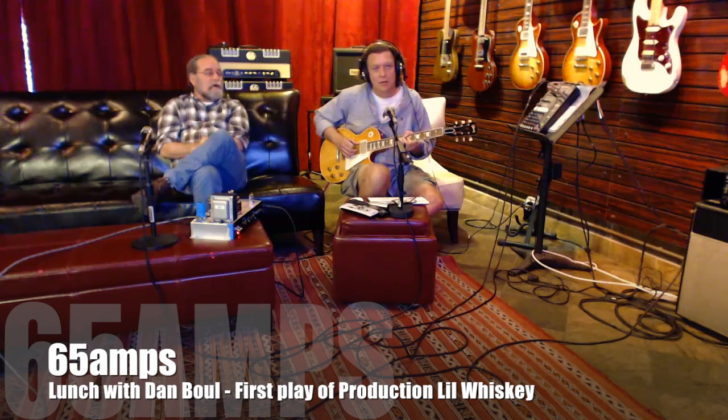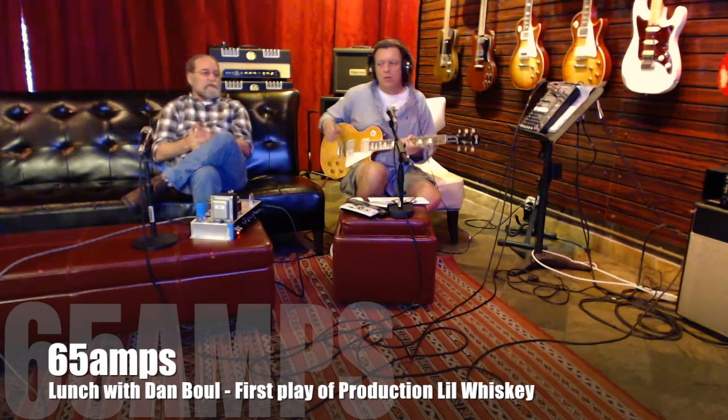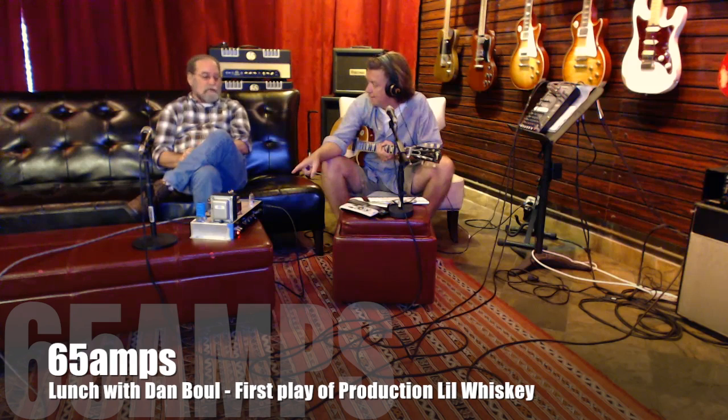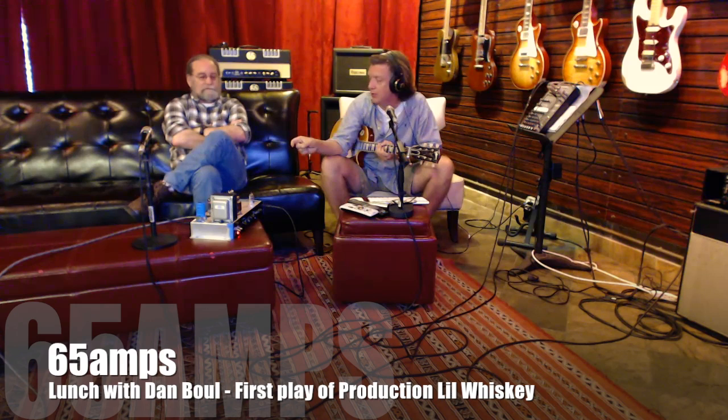As soon as they put a master volume control on a Marshall, to me they turned into garbage, and the 800 was worse, and the 900 was even worse. Well, the very first 800s, like '79, before they put the clipping diodes in them, were basically a Mark II master volume with an extra gain stage. 2204. 2203. Yeah, but that's what this circuit is. It evolved into the 2204. It has one more triode than a Mark II master volume. That's the only difference between a 2203 and the Mark II master volume, which are both great amps.